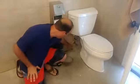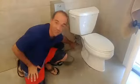Also show you in here, if you have a bathroom, you have to have the same situation. So here you've got water, but look down here, we've got valves that drain down to a low point. Over here, come over here, we've got a toilet again. You can see where the water comes in for the toilet, but I've got this drain valve down here that drains it out to the lowest point. So you're getting the idea. This isn't like a full explanation video on how to do that, but I wanted to give you guys a little introduction to that. Let's talk about a couple of other things here, like cabinets.